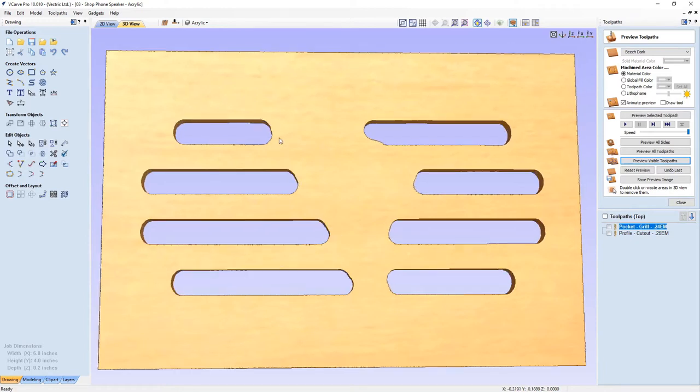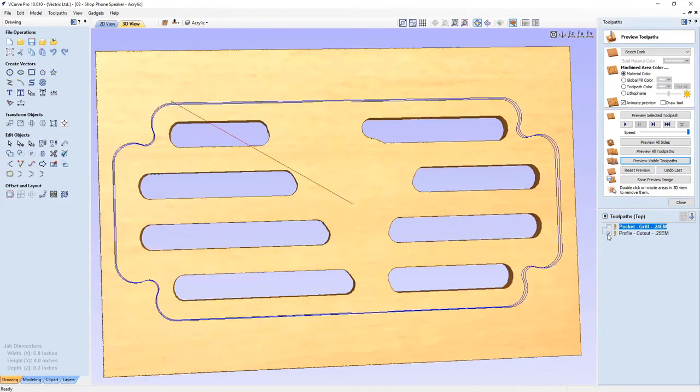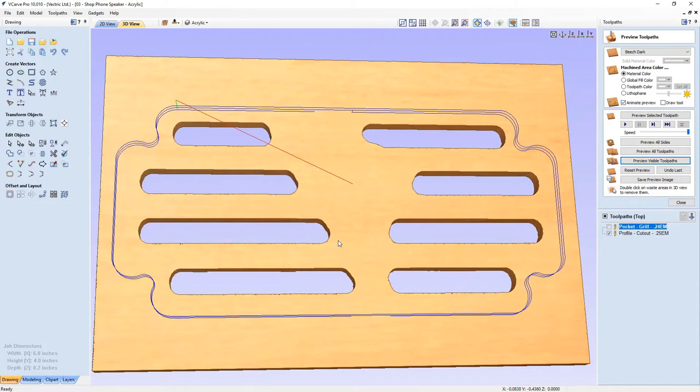And that's pretty much it. And thanks to the filleting I did, it cut exactly as I expected. Nothing was wrong. And then my profile cut. Now, the reason why I had thought I needed a double-sided tape was because I was concerned that it would be too hard for me to remove tabs. And I really resisted using tabs on the acrylic. In the end, they were the best thing since sliced bread to use. They certainly did do the job.